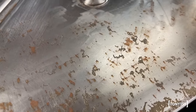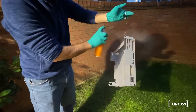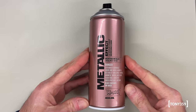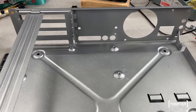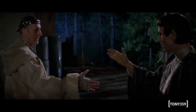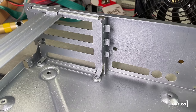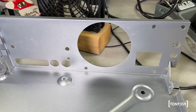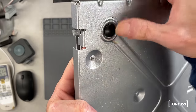At that point I could remove the rust with sandpaper, scrubbing, and citric acid. This took me forever. In the end the case was a battlefield and clearly needed a whole new coat. The unprotected metal would rust before my eyes and drying the case in the oven didn't help much. I applied some etching primer as soon as I could to seal the metal and it actually looked quite nice with just the primer. Chrome paint is very delicate so I selected a metallic silver one instead. A few coats of that worked well and the outcome is not bad at all. I can still see some rust bits in the metal, but I wanted to finish this project before Christmas 2063 — which is an important year if you know Star Trek. And it's done! I am so happy to see the metal cases done.